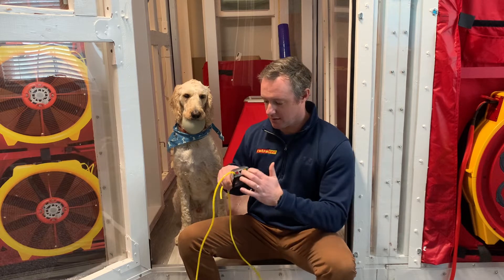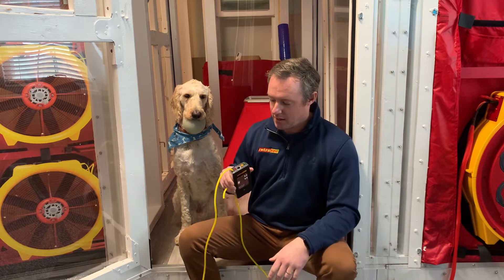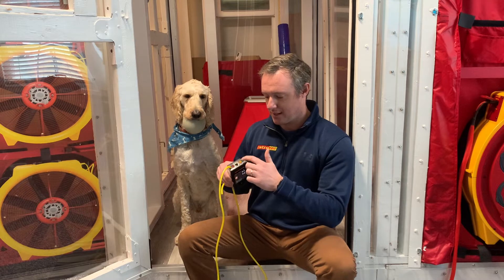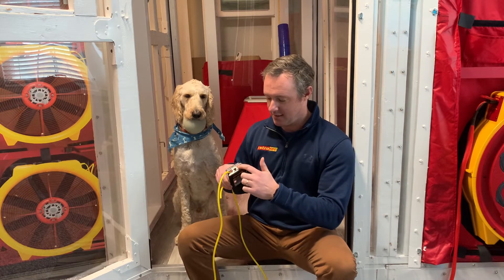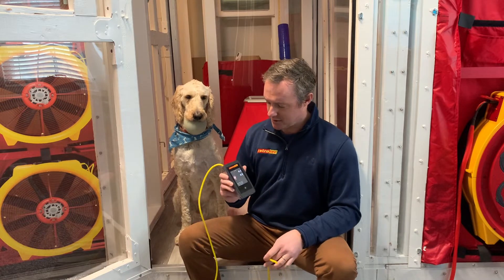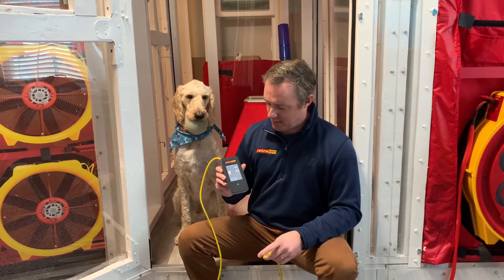If you're using the DM32 with the color-coordinated ports, you'll test blue against yellow, blue against green, then red against yellow, and then red against green. We want to make sure the DM32 is reading pascals on both channels.